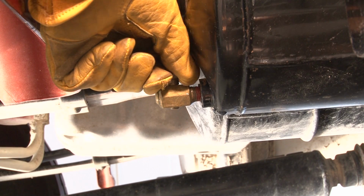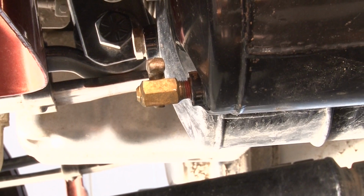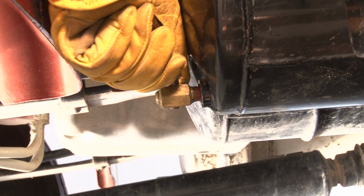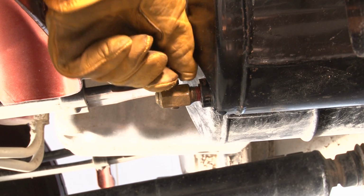On a vehicle so equipped, the reservoir automatic drain valve ejects moisture and contaminants from the reservoir to which it is connected. It operates automatically and requires no manual assistance or control lines from other sources. The reservoir should be drained and the valve should be examined periodically to ensure that the drain passage is not obstructed.